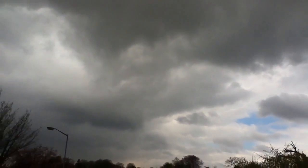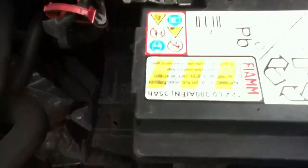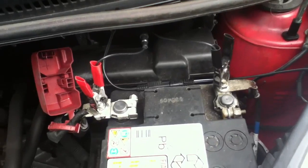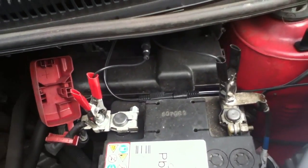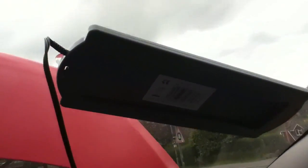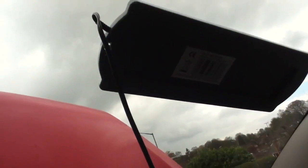Well, it is pretty dull and overcast today. I've connected the terminals of the solar panel to my car battery. The car battery is a 35 amp-hour — it's upside down — and for the purposes of this test I'm going to assume that it's been depleted by 10%, so what we need to achieve is a 3.5 amp-hour top up. The solar panel is now attached to the windscreen using those rubber suckers, facing right up into the dull overcast sky.